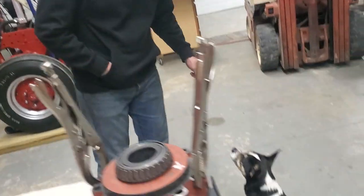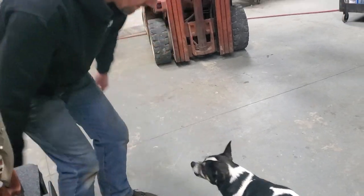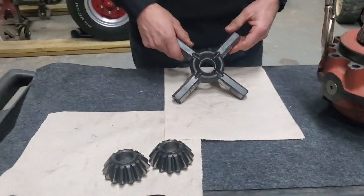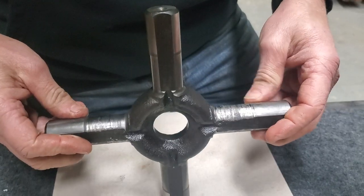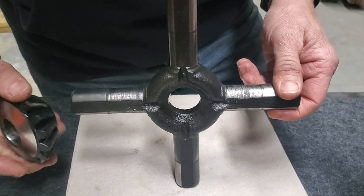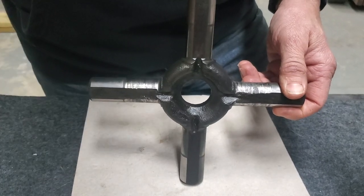There's our little shop helper — he's going to get on camera too. I'll start off by talking about the stock IH cross shaft. You can see it's in pretty poor condition. We've pulled with this for a few years and the gears started welding themselves tight on these shafts, so we could tell it was time for an upgrade.